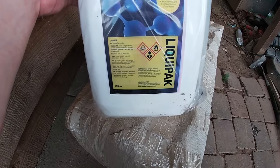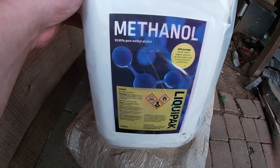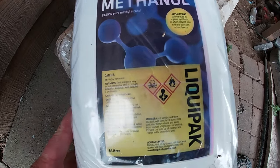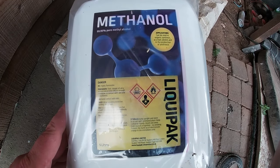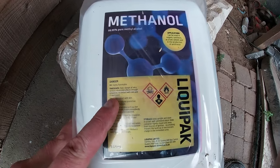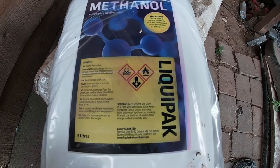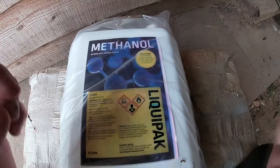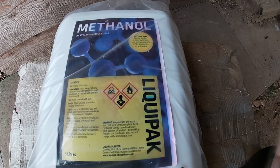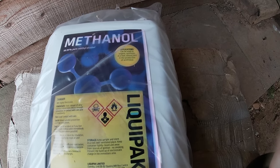The aim of the game is to use some sort of solvent to make the veg oil thinner. The most talked-about method on the internet is using methanol to mix into your veg oil to thin it out. It's a tried and tested method - if you're in a warmer country you can do this without any additional heating, but most places it's going to require some sort of reaction vessel to actually perform the esterification with the methanol and the veg oil. That's also going to leave you with a waste product of glycerol to take out of the oil.